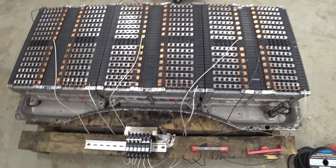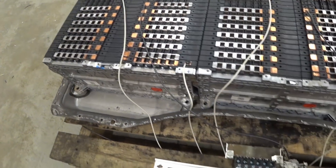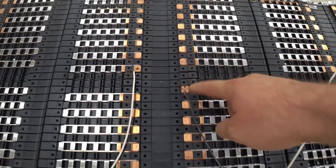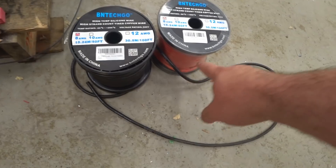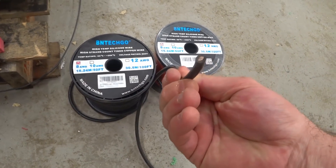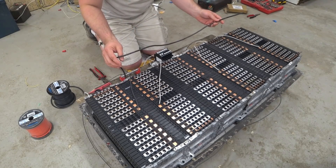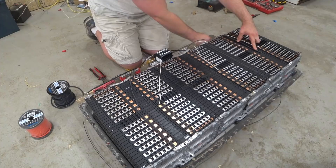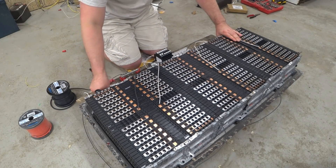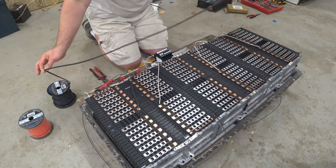When I do the final wiring of this battery, I'm not going to have the circuit breaker sitting out in the open — I'm going to tuck them up in this space nice and neat and tidy. I'm really excited about that. But when I go and put these connections on these bus bars, I need to have a length of wire coming off for that, so I want to measure what that needs to be. I need three positives and three negatives. This is the wire I'm going to be using — it's a nice eight gauge wire, I got both black and red, and it's a real flexible, high temperature silicone coated wire. So I'm going to measure this for the longest run, which is going to go from the middle bus bar, flow along the middle of the battery, come down, and then come over to the other side where it's going to connect up. So this is maybe three and a half feet.